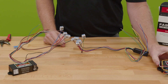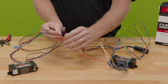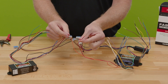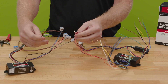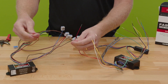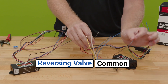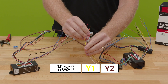Now let's show how you connect from your indoor unit to your heat pump. It's just red and orange. You connect the red to your terminal block or to your conductors in the heat pump for 24-volt power. You'll end up connecting three wires under this one: one to the wire from your heat pump or terminal block, another conductor going to the red at your indoor unit, and then an additional connector joins the oranges together, which becomes your communications wire.